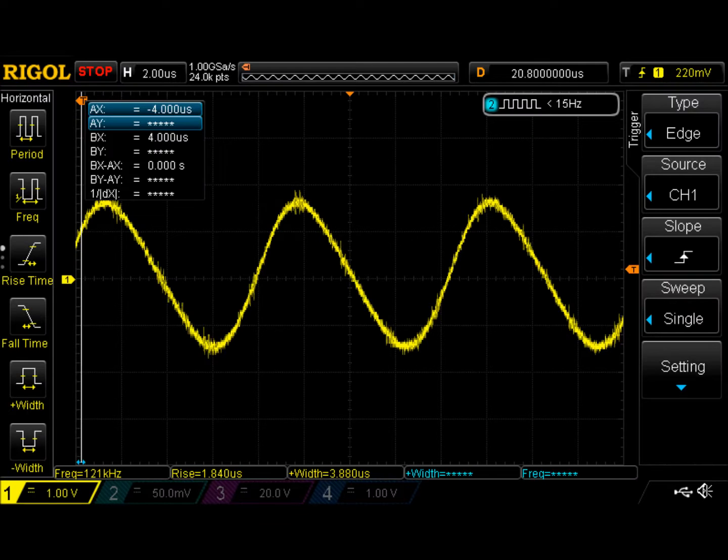One of the things that the app note states is that the circuit may need a gimmick cap added to reduce spurious oscillation. And sure enough, there's a 125 kHz sine wave running even when the inputs are shorted.